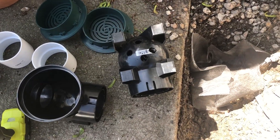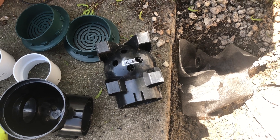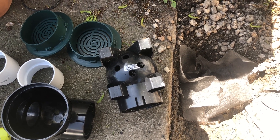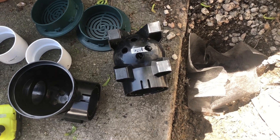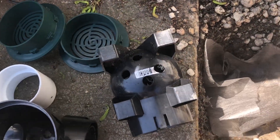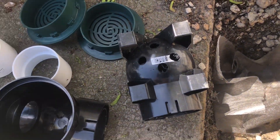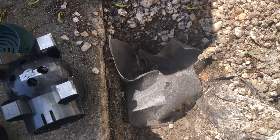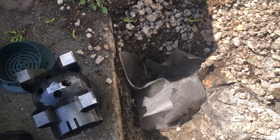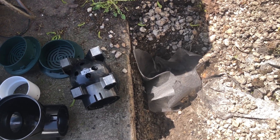And here we go. Always remember when you're installing catch basins to make sure you drill the holes in them, because if you don't, then the water is going to sit in them and become a mosquito breeding site. Nobody wants that at all. Also, remember before you install this, after you drill your holes, you have to put the cloth down and put some rock in, then put it in, hook it all up, and then backfill more around it with rock so that way all the water can drain freely into it and go out at the end where you desire.